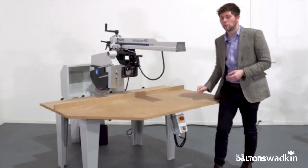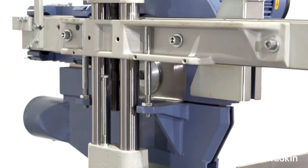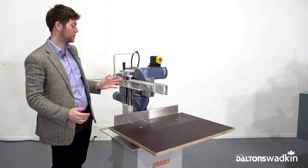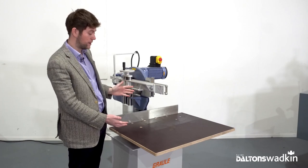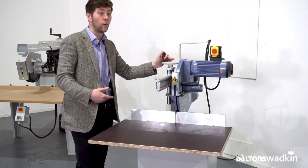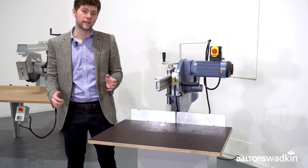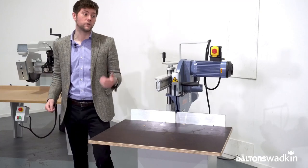Right away you'll notice on the Graal that it's a different design to the SCM and the Wadkin, with the guidance bars being mounted vertically rather than horizontally. Also, the blade is directly belt driven, which provides maximum power to the blade. The standard configuration machine — which is what you see here — has a 3 kilowatt motor and a 420 mil blade, giving a maximum cutting depth of 170 mil and a maximum cutting width of 450 mil. These features make the Graal ideal for applications such as fencing or weatherboarding posts, or anywhere where accuracy is key. The whole saw movement feels very light and super precise, and one very important feature dissimilar to the Wadkin and the SCM is that when angling or rotating the head, the saw line from the fence remains fixed, so you do not need to compensate your length as you would on the Wadkin and the SCM.